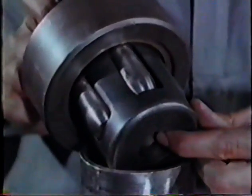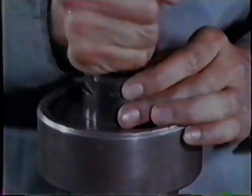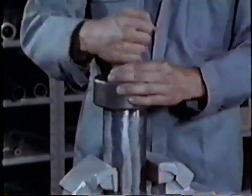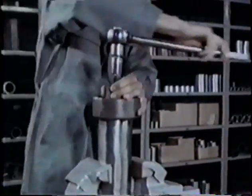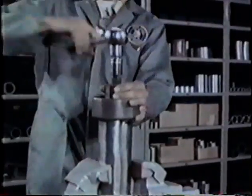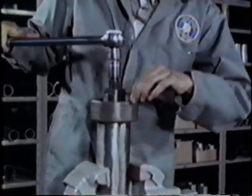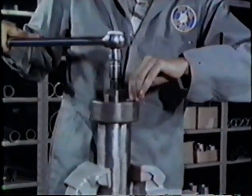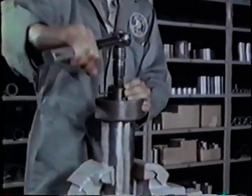The rolls of the expander press against the pipe from inside when the mandrel is turned into the tool. The number on the mandrel tells you how much the pipe is expanded with each turn of the mandrel. After the expander is in the pipe, loosen the set screw and turn the mandrel into the thrust nut to bring the tool firmly against the pipe. While doing this, it's all right to hold the thrust nut from turning. Now, tighten the set screw in the mandrel slot and rotate the mandrel. This will roll the rollers against the pipe and correct any out-of-roundness without appreciably expanding the pipe.